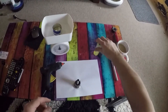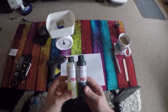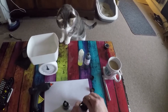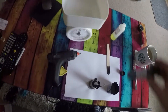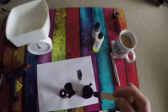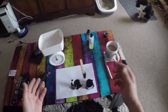Okay, so attempt number two. Different polyurethane. Little tip for you — when buying this on eBay, instead of searching for polyurethane resin, I searched for polyurethane rubber. And as you can see, this is 60A shore polyurethane rubber — mixed part A, mixed part B, stick it in the mould. This time as you can see I've gone a bit crazy with the glue. I'm pretty happy with that — it looks pretty perfect at the bottom. It's got a pot life of five minutes and a de-mould time of half an hour, so we'll come back in half an hour and see what happens.